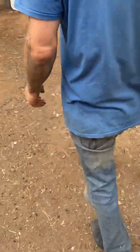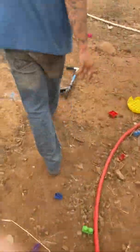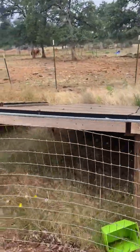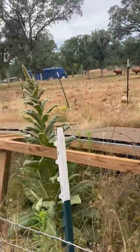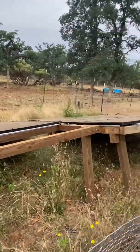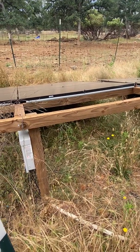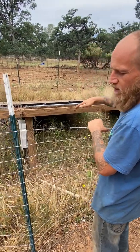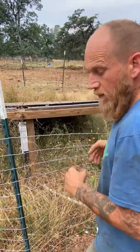Over here we have the solar panels. After you've got that put together, these are your solar panels. Very similar to the batteries, you've got to stack some of these together because each of these panels — today there's no sun but they're capable of about 30 volts — and we want our system to come in at 48 volts, plus you have to account for voltage drop. So you stack a couple together: 30 and 30 is 60, which comes in above 48, then that goes through the solar controller which drops it down to a nice even 48. You've got to bring your voltages in higher so you can drop them lower and clean them up so you don't have a varying voltage — it's always a good voltage.